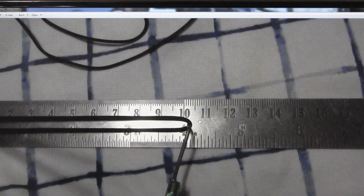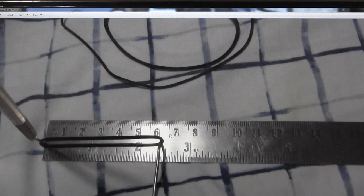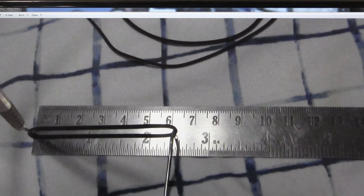We measured the secondary belt — it was just over four inches. I put in a four-inch belt, so the belt I put in was just a tad shorter than four inches. The smallest belt was just over 60 millimeters — just over six centimeters — so I put in one that was just at six centimeters. Maybe I need to put a smaller one in, I'm not sure.